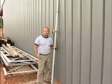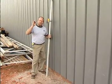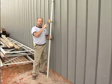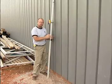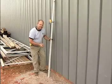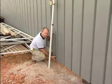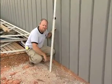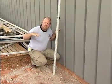Here we are getting ready to actually shoot our elevations. Remember, we turned on the laser level and had a green light which indicated that it was in fact level. So now we're getting ready to use our sensor. The way that this works is we're getting ready to shoot our elevation, which is sometimes referred to as a benchmark, and our elevation in this case happens to be the bottom of our building. So when we pour our concrete slab, we want to make sure that we have the sufficient amount of slope from here — being our first elevation — and thirteen feet out we want to make sure that it is in fact sloped so it doesn't hold water.